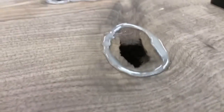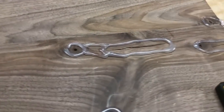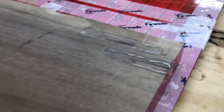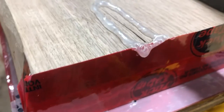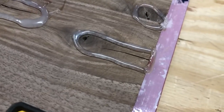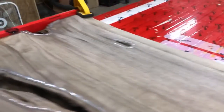I'll show you what I mean by going around it — you don't have to be right on the edge, it just has to serve a purpose: creating containment. It's going to be ugly, but it doesn't matter. On the edges I try to build up a little bit so the epoxy doesn't flow over and run out of the crack. This is going to get routered and cut down anyway, so it's really not an issue on this particular project. Hope you guys enjoyed this video — see you on the next one.